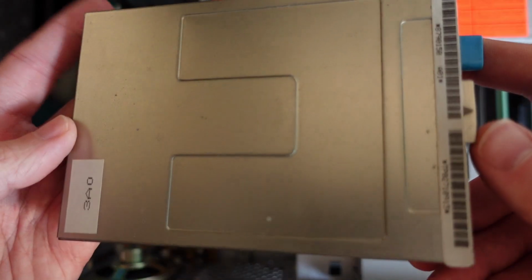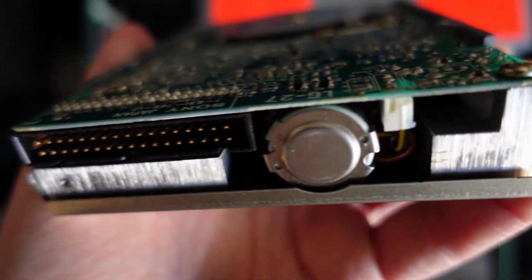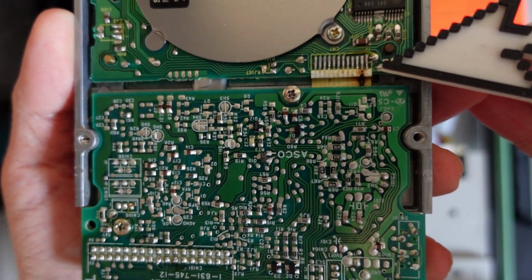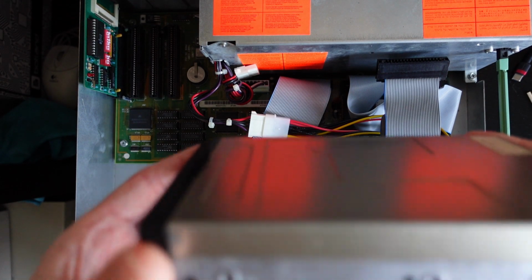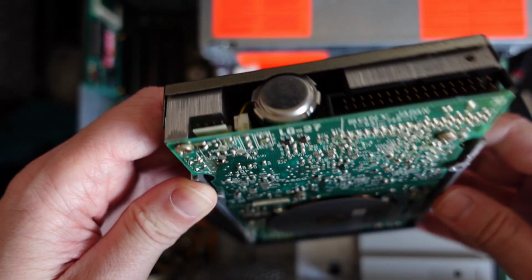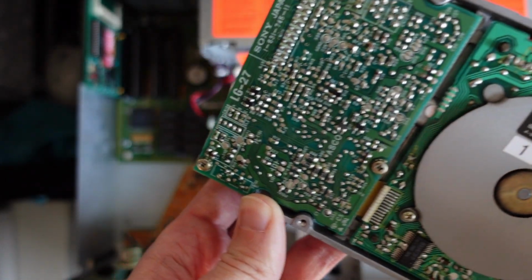As I mentioned in the previous episode, the original Sony drive stopped reading floppy disks. What's worse, I finished it by connecting it incorrectly, which can be clearly seen on the electronics. I quickly managed to buy a very similar model on a local auction service. The electronics are almost identical, but the important difference is the traditional way of powering it with the Berg connector, not through the ribbon cable, as expected by the Tandy 1000TL.